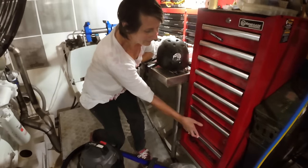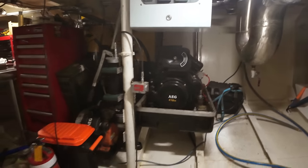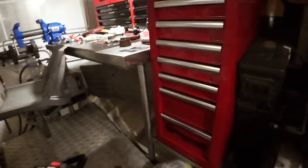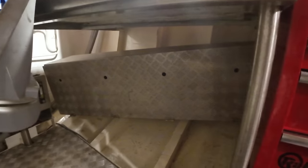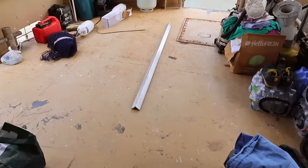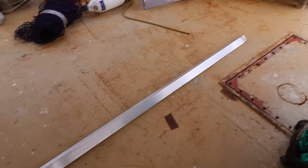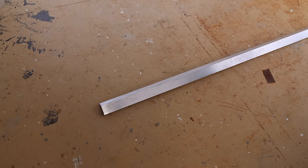Burke's going to crack on and get the new injector and fuel system up and running on the generator over the back. I'm going to get the big aluminium box that's haphazardly thrown under the bench mounted properly so we can do the final cleanup. The easiest way to mount this shelf is to use a bit of 50 by 50 by 6 mil aluminium angle — chop it into three lengths, bolt it to the ribs, sit the shelf on top, and rivet the shelf to the angle. Now that we've got three of those cut, time to start getting them into the boat.